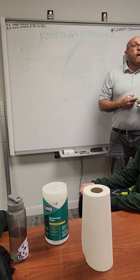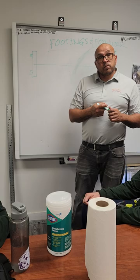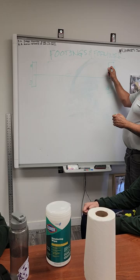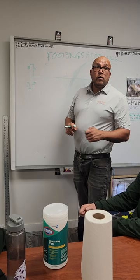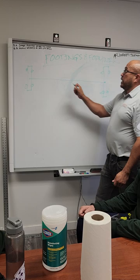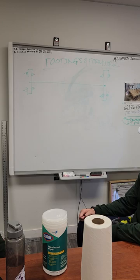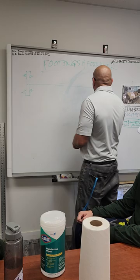It's pretty much just a metal stake, and it does have holes where you can nail in your two-by-four. The stakes would be on this side. Once you put the line on and pull it tight, if the stake was on the other side, you'd pull that nail right off. So this string line is basically going to give you a straight line to start creating your formwork.